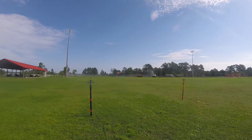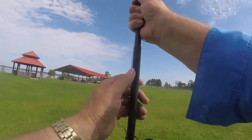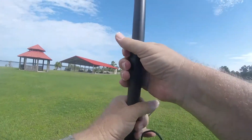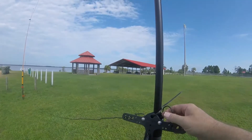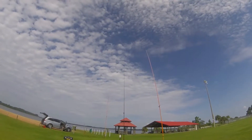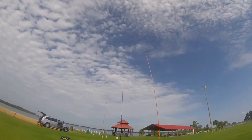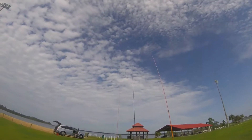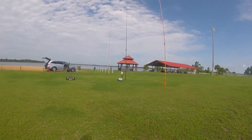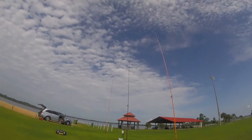I've got the three supports for the antenna set up and I'm going to raise it now. We cycle among the three poles and just push them up. There are attachments to the top, and eventually we get the entire loop deployed — it's rather easy to do. The loop antenna is deployed: 30 feet horizontal, 20 feet vertical, and the lower wire is 10 feet off the ground. It has a 300 ohm line to an AH4 tuner. It is physically impressive.